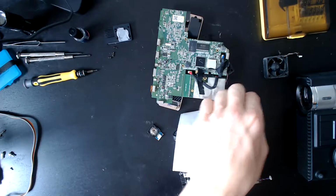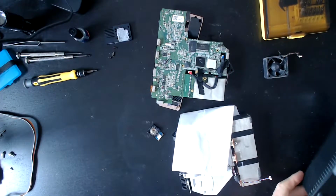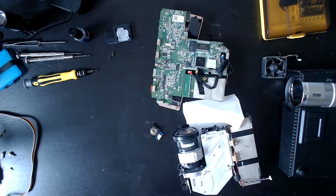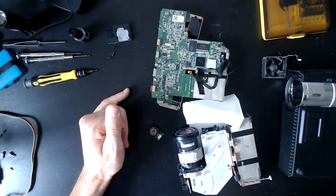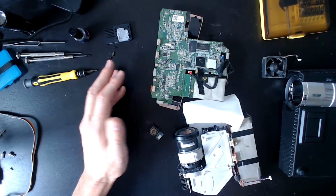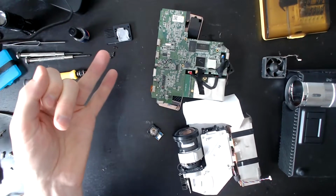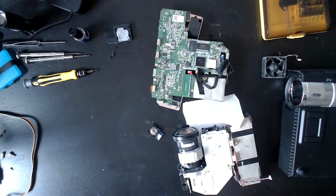This is it. Yesterday, I took two projectors that looked somewhat like this, and they had two different problems. One projector had basically lost blue, and the other projector would start to power on and then it would just stop, very early in the process, so the fans wouldn't start, it didn't emit any light, so yeah, I don't know how far I got through that process.